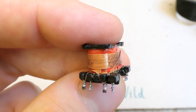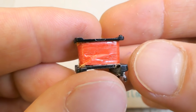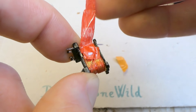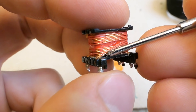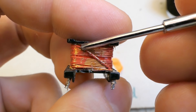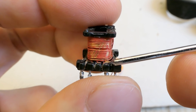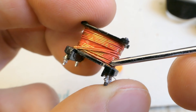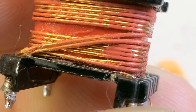Removing the first half of the primary: it's 22 turns. Then the isolation - sticky tape, one layer, two layers - and the secondary. The secondary terminals seem to be made of two wires in parallel, wound quite weirdly: it starts from the center, one wire ends on top and one at the bottom. As always in these dodgy transformers, the secondary is getting very close to the ends of the primary - nearly touching it here and probably also here. I don't really like this.